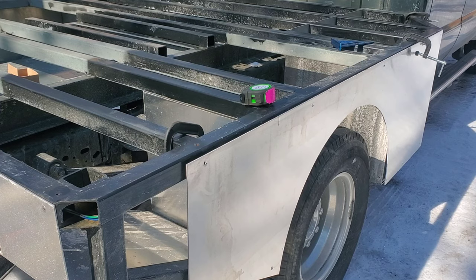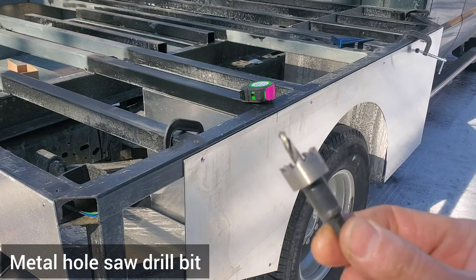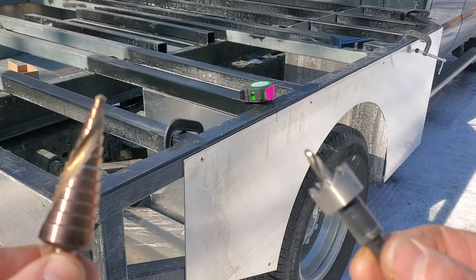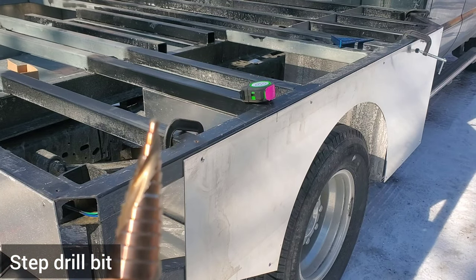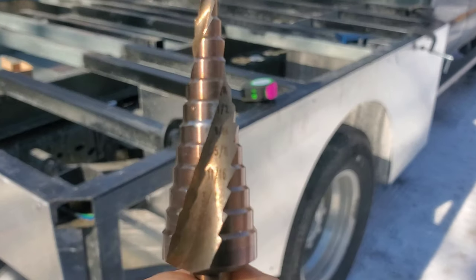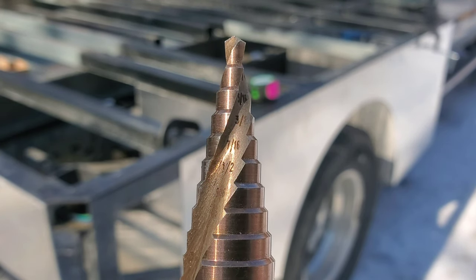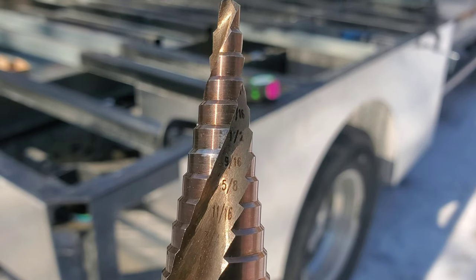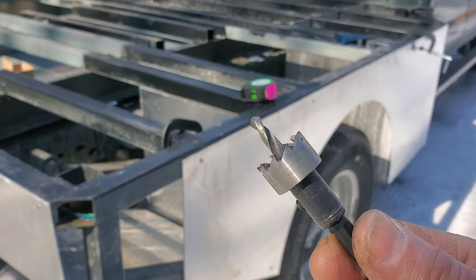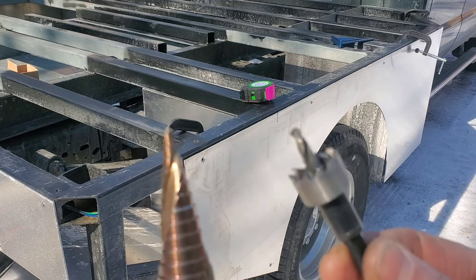Now there's a couple bits that are very helpful for doing the 3/4 inch holes. One, this is actually one Jason has, very similar to a bimetal hole saw. I'll try to look that up, get that information put in the description. And then also there's just your traditional step bit. The carbides are the best way to go. And these actually have measurements listed on them, which may or may not show up, but you can kind of see them right there. So it allows you to see, like we're doing a 3/4 inch hole. Now this is not the most accurate way. You have one of these, this is much more production oriented to make sure things are consistent. But I just wanted to show you these two options for doing your holes for the marker lights.